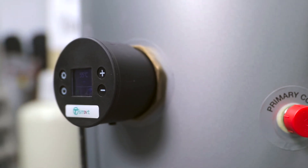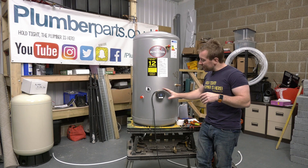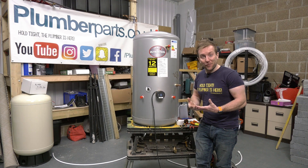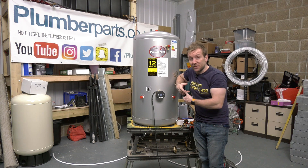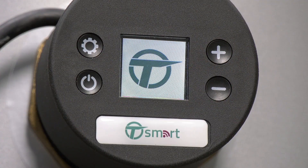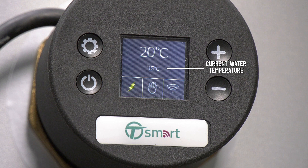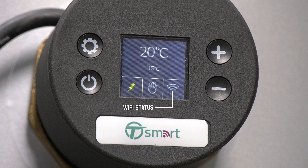That's the install process complete — all you need to do now is reinstate the electrics and watch this little baby light up. The control we now have over our water is great, and another thing people haven't really thought about: it's also a monitor for the temperature of the tank. You can accurately keep an eye on the tank temperature from your phone, even if you're using a boiler to heat it — which is common in the UK. For someone with Economy 7 or Economy 10 we've suddenly got a timer all in one. We can switch the T-Smart on and off using the power button: 20°C is our current target temperature, 15°C is the current water temperature, the zap icon means the immersion is calling for heat, the middle box shows current mode, and the bottom right shows wi-fi status.